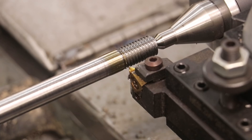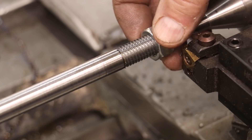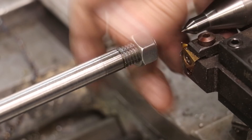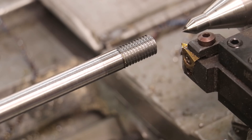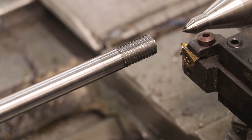I stop just before done and do a test fit with a half-inch nut — that's actually a nice fit right there, so we stop. Once those thread crests come together, that's an indication you're getting close. Sometimes I'll put an indicator on and look up the depth of cut, but I usually just go for a test fit. Looks like that thread is cut. We're going to flip it around and cut the thread on the other side, and this one will be done.